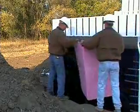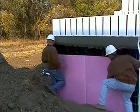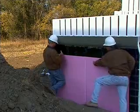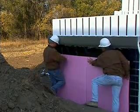Alternatively, you can use other sheathing available at your local building supply center. ARCS recommends you backfill within one week of installing the membrane in order to protect the membrane material from UV degradation.